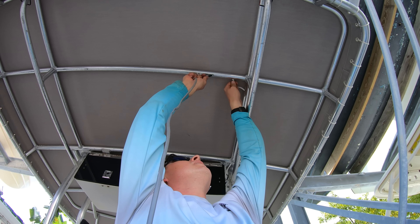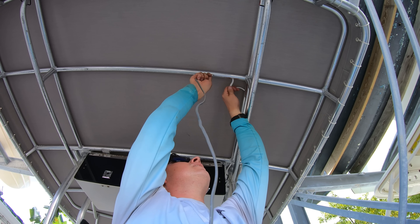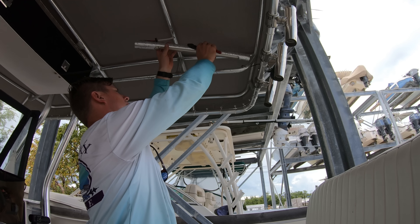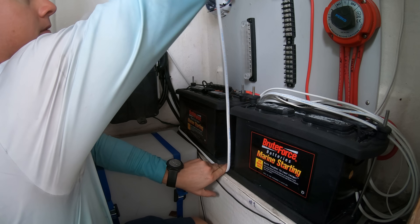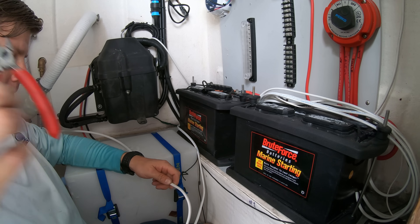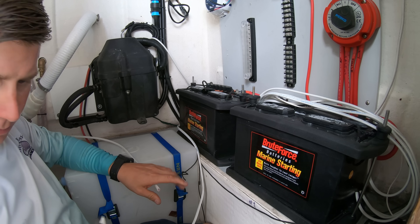For the wiring, it's best to run the wire up to the item and then back to your console — this way you don't cut anything short. Starting from the component and then ending at your bus bars, fuse panel, or junction bus bars gives you the ability to make sure you cut the wire to leave you the length to get them strapped in properly.